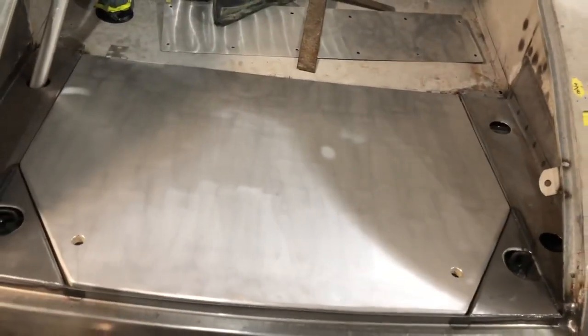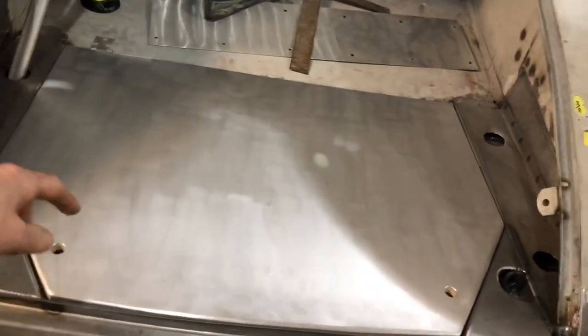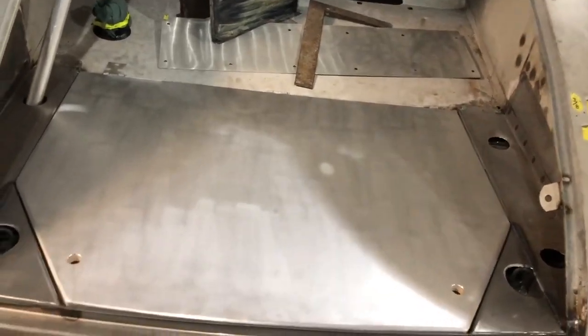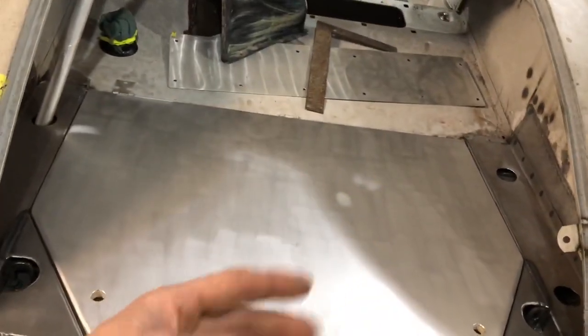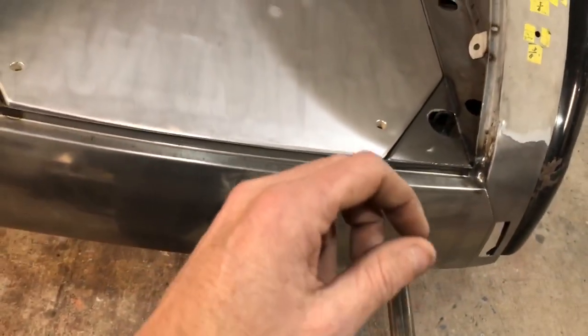It's out of wood — I have it latched right now. What I did on this panel is I took a set of dividers after I got my wood to fit, and gave myself about an eighth-inch leeway on each side all the way around. You lay a piece of aluminum out and figure out your gap on the dividers as the scribe, and you scribe all the way around the panel. This particular side, this front, and this side had to bend.